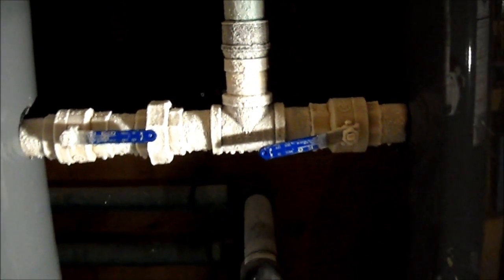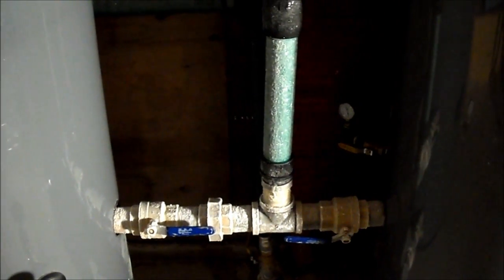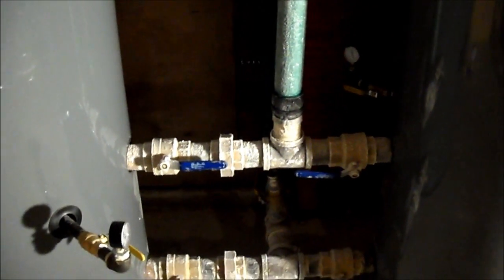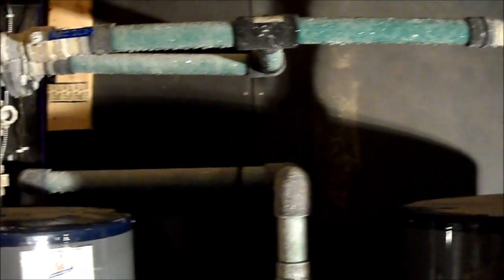On the other side of the wall there are our heat pumps. The supply and returns are coming through on the chilled water from the heat pumps. We've got the tanks in parallel — supply water and return water. At the bottom here we've got rink return, and on the top in parallel we've got rink supply. We've come out in parallel from the tanks.